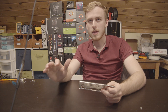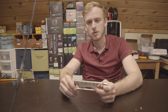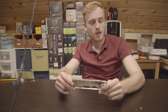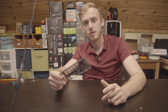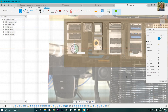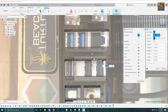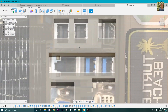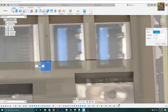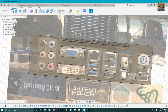The RGB lights you'll need are around $9 to $10, and that's a set of three strips — though you only get one controller, so keep that in mind if you're making multiple. Also make sure you get clear filament, because the light needs to go through it. I also decided to add connecting pieces between the USB ports and cut some holes a little larger for clearance. This makes it stronger, because very thin pieces of 3D printed material can have structural issues if they're not connected enough.